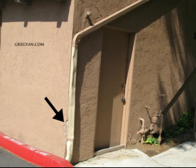And of course, the dent in the building and the damage to the downspout tell us that they have other problems, maybe some vehicles, since it's next to a street. Someone's backed up into the building a couple of times, squashed the downspout, and who knows what happened to the upper areas of the downspout. That's hard to imagine. Maybe just someone pushing it with their hand, vandalism, who knows. But these are additional problems that need to be addressed. You don't want someone backing up into your building. You might need to put some type of metal railing, attach it to the building, so if a car does hit it, it's going to hit the railing instead of the building. Again, this is extra money you're going to have to invest in the property to prevent other things from happening, but sometimes it could be well worth it.